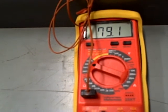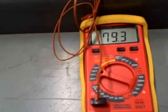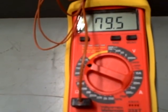I'm just going to cavitate it. It's kind of gasping. Lost quite a bit of my flow already. Most of the time you'll see that temperature is starting to increase on that because there's no flow.